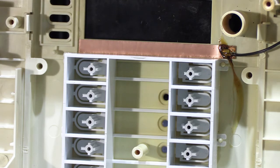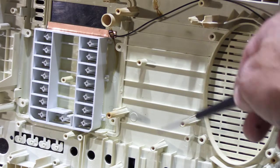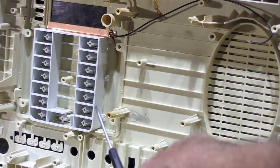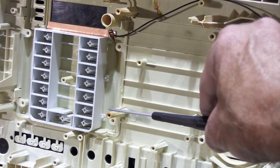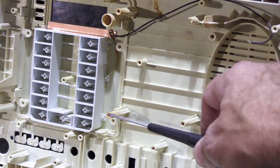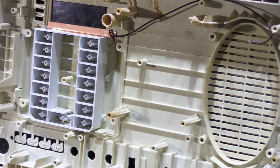It's not nearly as discolored as the front but it is very discolored for something that was closed up inside the wall. Another problem with this particular set has to do with the plastic standoffs. These stand up off the back of the face plate — they're molded, they're part of the face plate — and this is where circuit boards sit, and little screws go through the circuit boards to mount everything to the back of the face plate. If you look carefully at the end of this one, it's a lot more discolored and darker, and this is from exposure to heat on the main board where the amplifier and the big aluminum heat sink are.